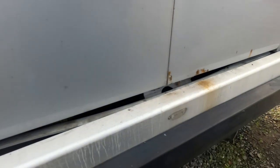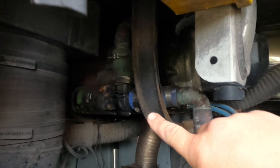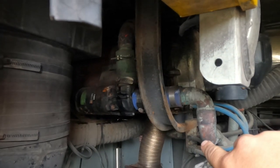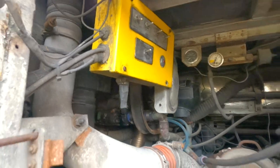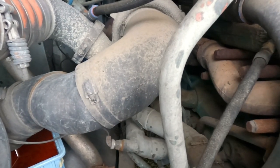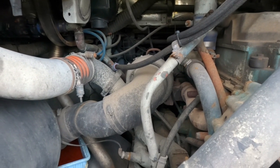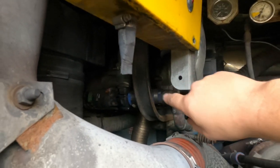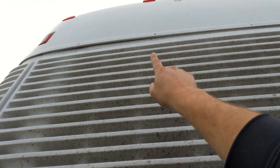Here's what I'm talking about - it's a little dark in here but you can see a coolant pump line comes in, goes into that pump head, and then straight up. That entire pump is held on with a hose clamp. The plan is to remove that pump and use that 90-degree elbow to go from here straight up. That coolant line goes through an elbow straight to the side of the engine block. The water pump is up here, so I don't know where in the system that is, or if it bypasses the thermostat. There are some valves back there that isolate that half.